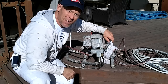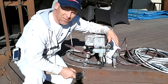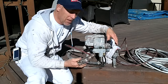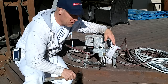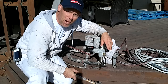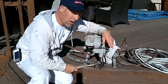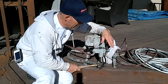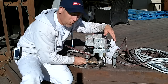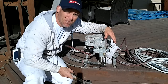Typically, you can fix the problem of the sprayer not priming with no tools. Sometimes the piece of debris won't pass through that ball, and just a little tap will get it to flow through. Having a hammer can be a good solution. You just don't want to use it too hard. The first thing we do if the sprayer's not priming properly is tap on the fluid section with a hammer to see if that resolves the problem without taking off the intake hose — because when your sprayer is loaded with paint, taking off the hose is a bit messy. While the sprayer's running in prime, tap on the fluid section lightly, and that tap is sometimes just enough to get the piece to pass through.